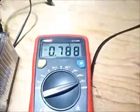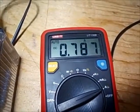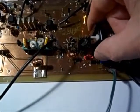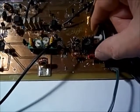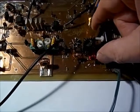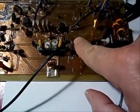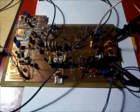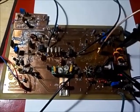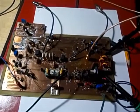The current being drawn by the IRF-510 is about 780 milliamps. If I feel my heat sink — yes, it's getting quite hot. If I hold my hand there for two seconds I have to let go; it gets pretty hot. So the heat sink is getting quite warm, and it looks like it's putting out some power. I think everything is in agreement that I'm getting about 5 watts coming out.